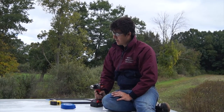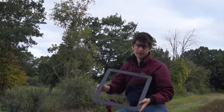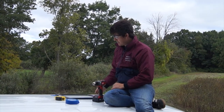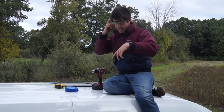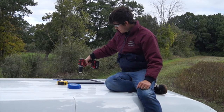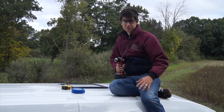Today we're going to install our roof fan — it's a Max Air fan. The first thing we did was buy an adapter, a piece of plastic we got online off eBay — we'll link that in the description. We set the adapter on our roof on one of the ribs and outline it in tape so it doesn't move around when we're drilling. Then we punch a hole through the roof through the center of the adapter space just to make sure everything's aligned properly. Measure twice, cut once.